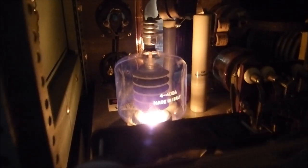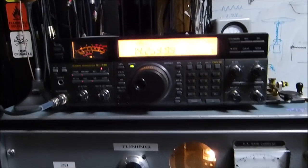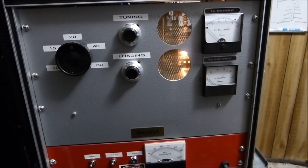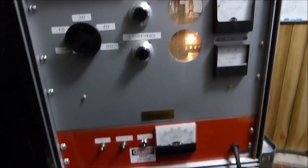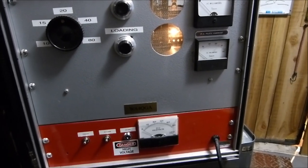So I didn't hurt the tube. You can see a tiny bit of blue in there, just that beautiful kind of blue, and it's starting to turn red at the bottom. I think I rejuvenated this tube too. I had to show you that so you wouldn't worry I destroyed it by running the cathode current so high. You can super-heat the thorium-tungsten filaments and boil some of the thorium back out to the surface — we used to do that in old black-and-white CRTs.